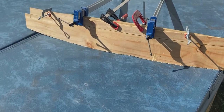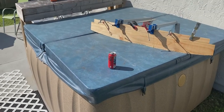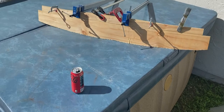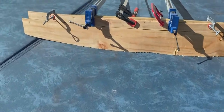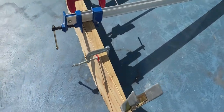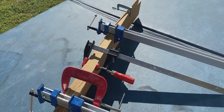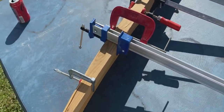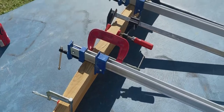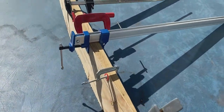The reason we're over here by the jacuzzi is because I had to steam bend this piece — it was very warped from getting wet and drying off while leaning up against the wall, so I went ahead and threw it in the jacuzzi for about 15 minutes. Then I clamped it to this curved piece of wood, which is the off-cut from the piece holding the base for the shelving I just showed you. Now it's all clamped up and drying in the sun, and hopefully it should maintain that shape.